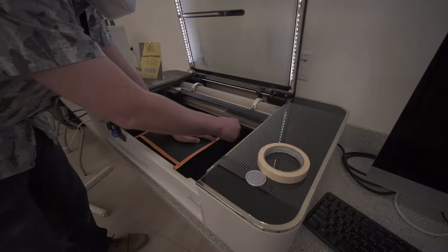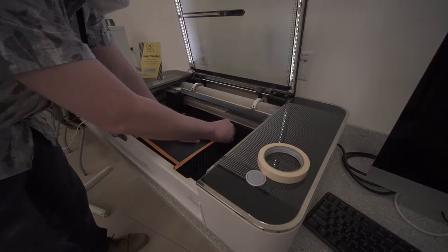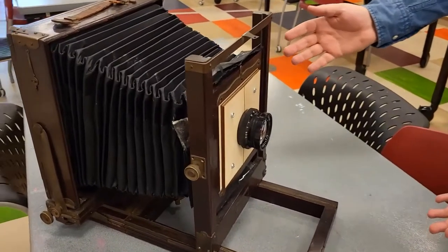I found a website that generated bellows designs for my camera frame. Then I brought those designs to Eric at the Eastman Center Library, and we basically went ahead and translated those designs into laser cutting files, sort of cut them out of card stock. I was then able to take those card stock ribs and make full-on bellows out of them.